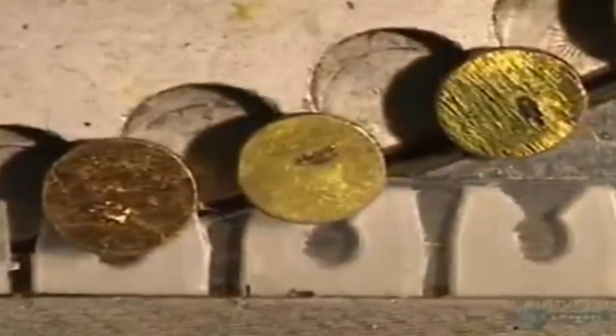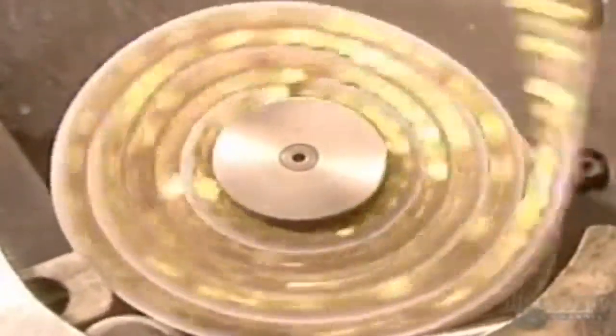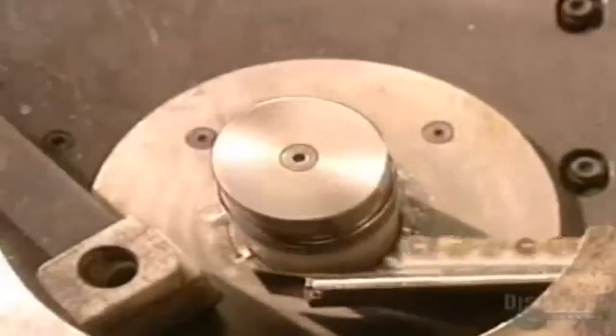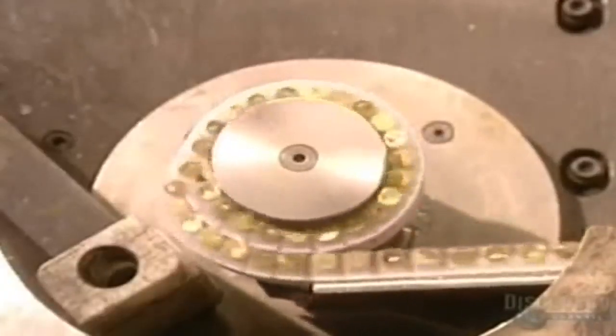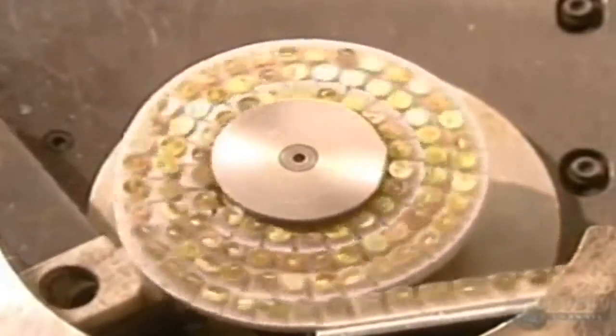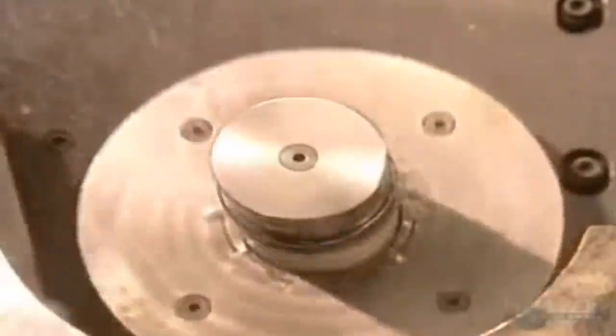This machine inserts 167 nails into each roll. The plastic strip has teeth, and the nails hook into these. They handle the rolls with gloves, since the coating applied to the nails is not yet dry. This machine produces 5 rolls a minute for a total of 835 nails.